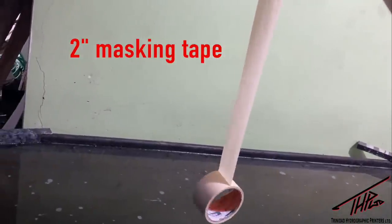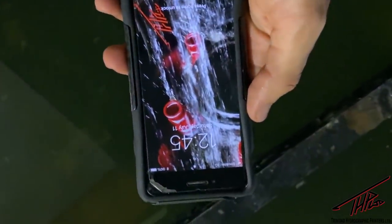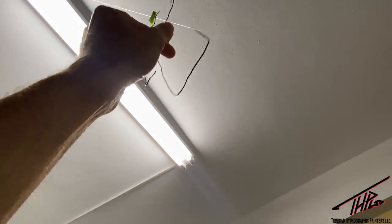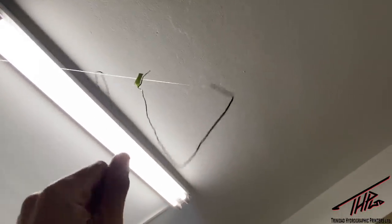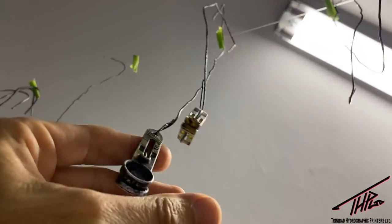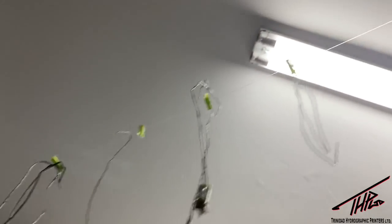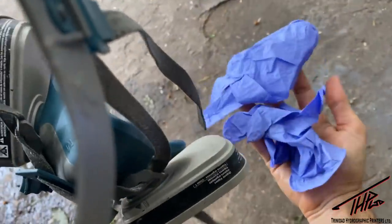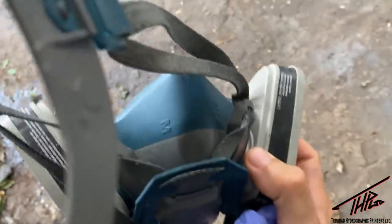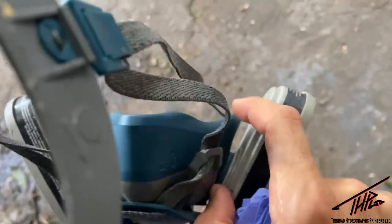Make sure you have a timepiece — either a phone, a watch, or a clock on the wall. Make sure your wire hooks are ready: I got small hooks, clothespins, and big hooks for big or heavy parts. For personal protective equipment I use nitrile gloves which I often reuse. My respirator is a 3M — this one with the blue rubber lasts really long; the grey one dry rots fast. I've had it for over a year and just change the cartridges every so often.